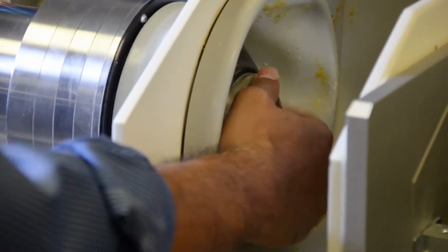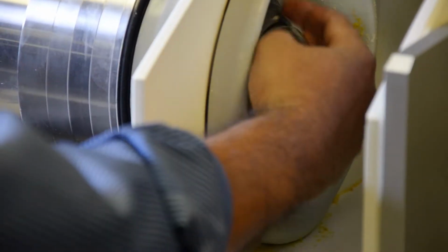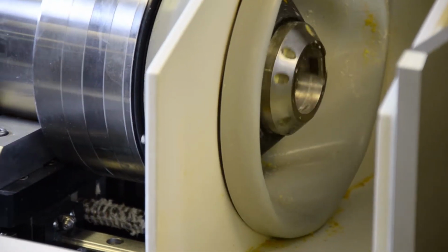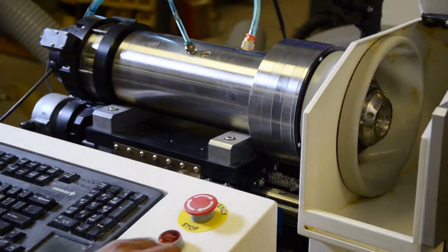This one is C axis. This is spindle. You see it's spinning. It's freely moving. There is no restriction on it. As soon as you touch it, it will move. This is air spindle. It should not have any friction or anything. If you feel any friction or binding, that means there's something wrong in the spindle. It's not in a good shape.